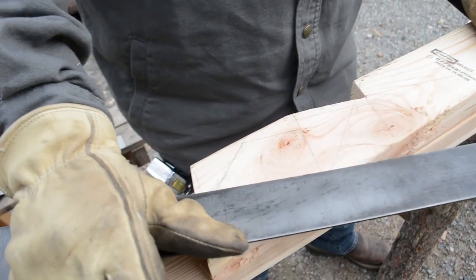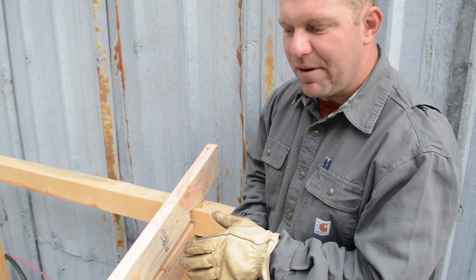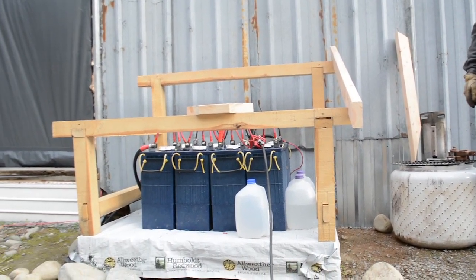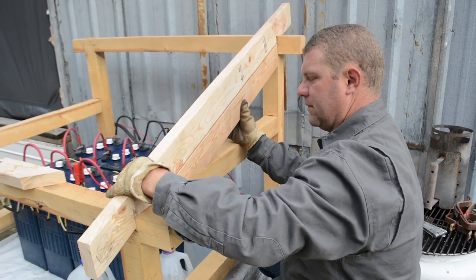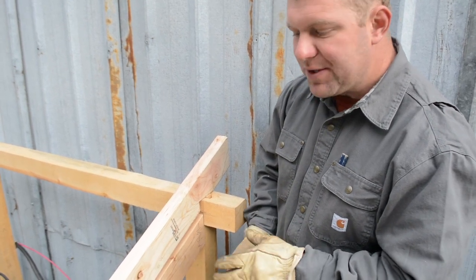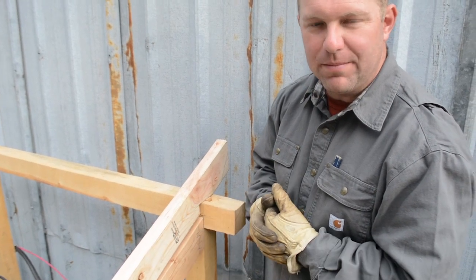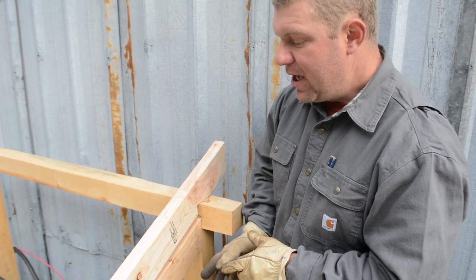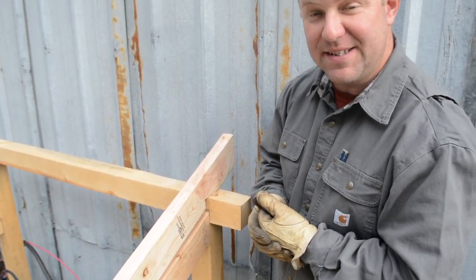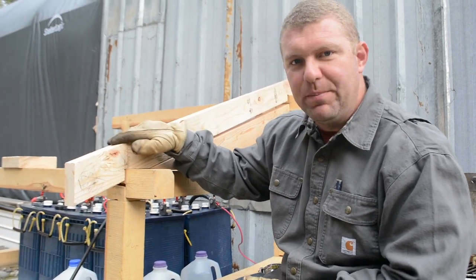It's a chance for us to work with our timber framing square and learn some of the roofing concepts. Part of what makes this roofing project a little complicated is that our battery box is located just adjacent to our cabin and we need the lid to open fully so we can access the batteries for maintenance. So understanding the proper tail to put on the rafter was something we had to measure and figure out. We also want to make sure that the siding and everything is nice and tight to keep these batteries relatively warm during winter.